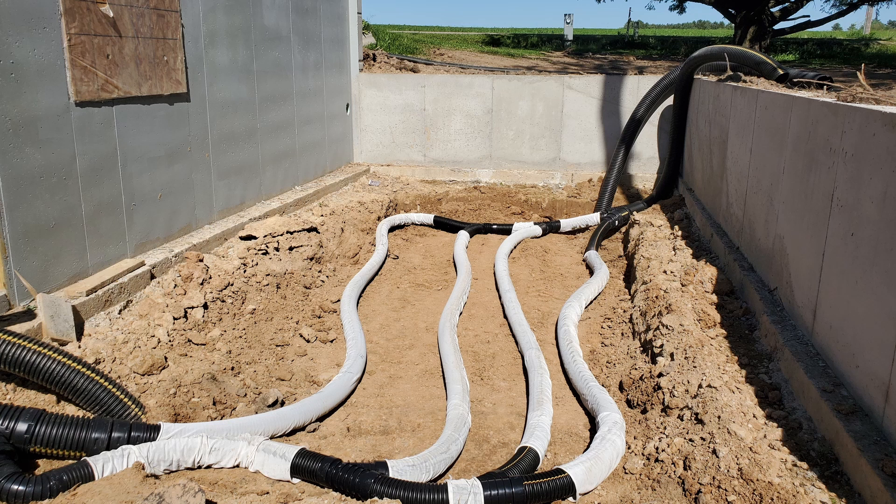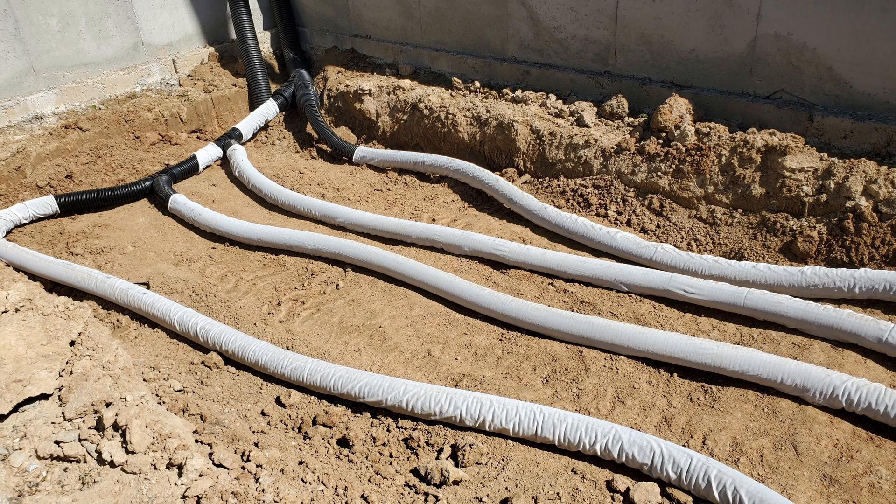There's only a degree or two of temperature difference between the air coming out on either layer. I think theoretically, if I'd gone even deeper and really doubled down — layered it in two full layers underneath — I could have drawn off more heat from the earth. But it does pretty good even just with this setup. So we've got one layer at about four feet and the second one you're looking at now at roughly two and a half feet.